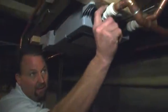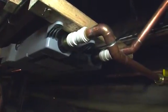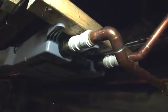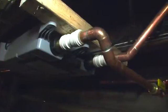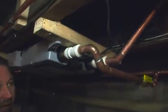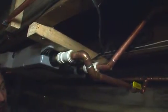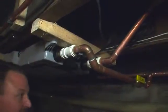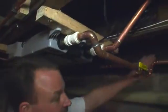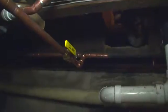The biggest thing right off the bat, I guess, is the design of the fittings that Moen has decided to include along with this valve. They're push lock fittings, easy to get off, easy to get on, no soldering. I soldered all this before I actually inserted it into the quick disconnect, or stab fitting. After that I used Pro Press just for the water tie-in, which we tied into a 3/4 line, which Moen definitely recommends, 3/4 or bigger.